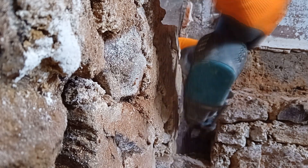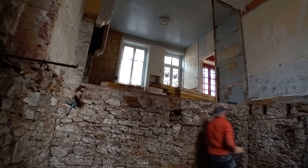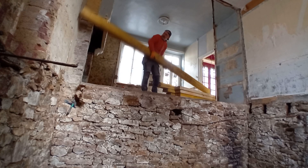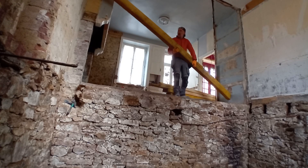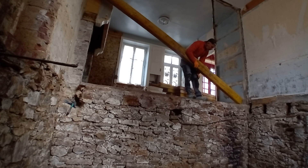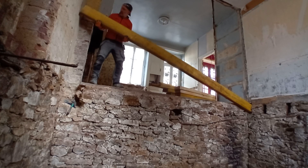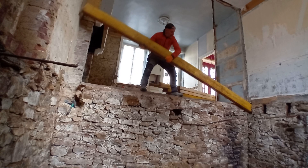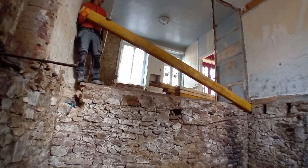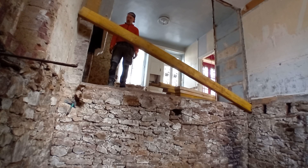After looking inside the pocket on this side, it actually backs on to another void under the dining room, under the sitting room. So I decided to knock the back out of it to see if I could get a full-length beam in. This beam here is 4.3 meters — it's really obvious when I put it in that it's way too big. There is a size that'll fit. You go from almost the back of one pocket to just above the pocket on the other side. There's also wiggle room with the walls in that I can take the plaster off and chip away a little bit, so I wanted as much timber as possible in the pockets to get as much support as possible.